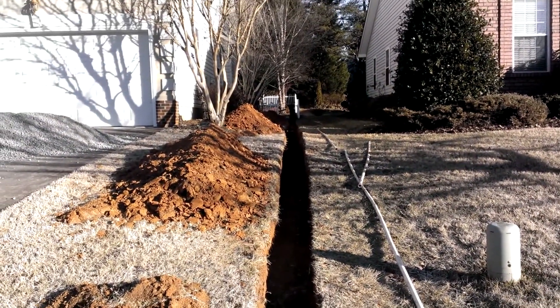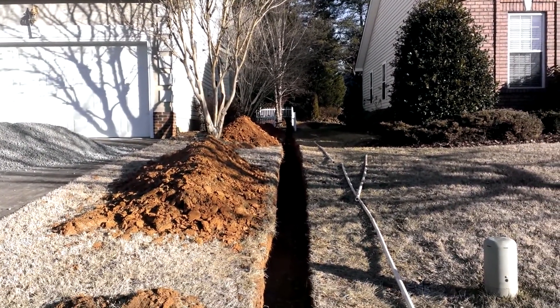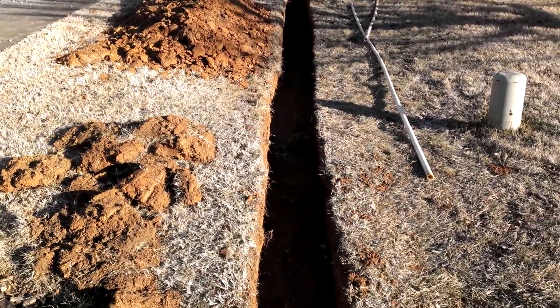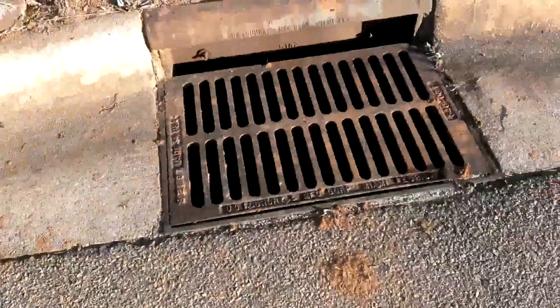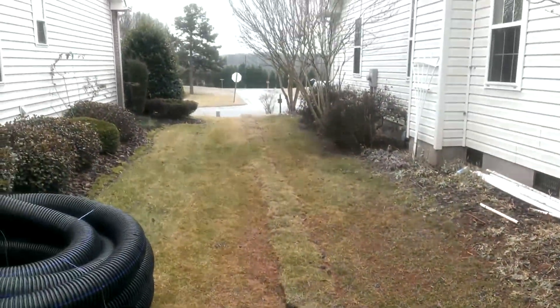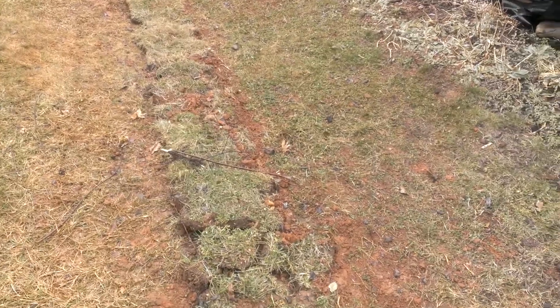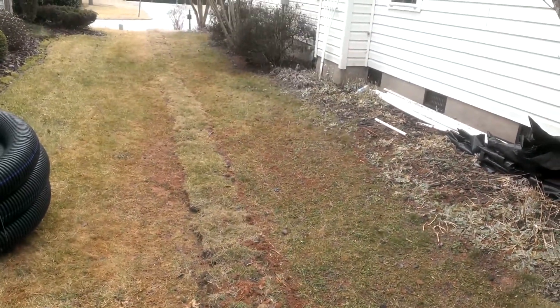We had a lot of frost and really cold temperatures, so it was hard to finish the digging quickly. We are almost ready — we're going to put a basin before the gate to collect the water from the gutters, and that's how we'll make sure the water gets collected and diverted to the rainwater basin. The first two sections of six-inch corrugated solid pipe were extended all the way — about 200 feet total to the street. We saved the grass that was on top and purposely put a little more dirt on top so that once it compacts naturally, with the pipes on the bottom, it will reach a more level situation.